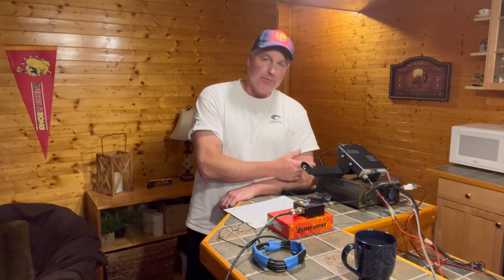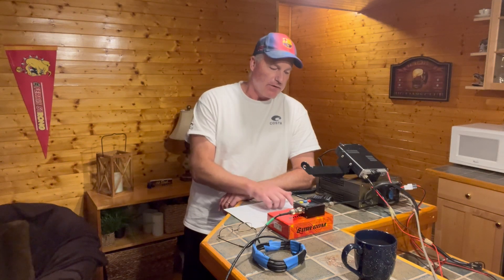It's supposed to have a good SWR for both, so I got it mounted on the tripod over there. I'll take the camera down and show you that in a minute. I will be testing the SWR using the ICOM here. Going to start out at 5 watts, then I'll go to 50 watts. Got the Surecom SWR meter here for VHF and UHF. We're going to be checking both of those. I'm going to have the antenna mounted horizontally, at a 45 degree angle, and then also vertically. I'm a little concerned about going vertical — some of the legs on the tripod are metal and I have a feeling it could interfere. So I may have to look at changing out the tripod. Let me take the camera down, show you the antenna, and let's get started checking the SWR.